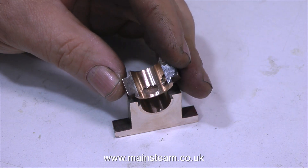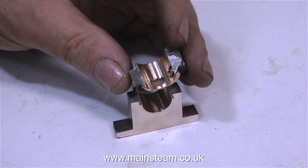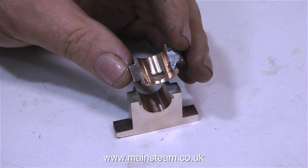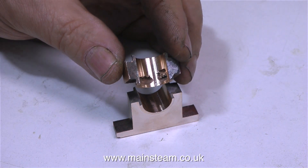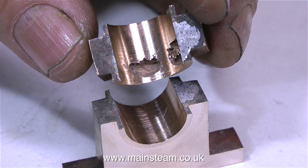Just look at this. This casting is definitely not auditioning for casting of the year — but it happens. These are called blowholes, and the good thing is I've not really wasted too much time. Sometimes when you're machining cylinders, you'll get a blowhole after you've done a lot of work, and that is very, very frustrating — it's a good idea to have a stone slab on the bench to bang your head on if this happens. You'll also notice that the reamed finish isn't very good, because all the sand and grit that came out of the blowhole made a bit of a mess of the bore.